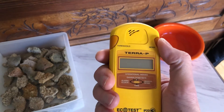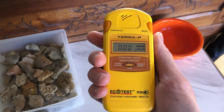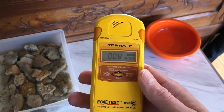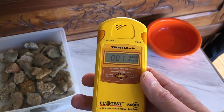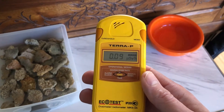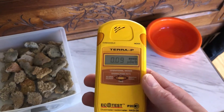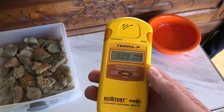I'm going to go ahead and turn it on. It goes into the last mode it was in, which is the gamma dose rate. In a moment you should start hearing some clicking, which is just the background radiation. I live in Colorado — the background radiation here is just naturally a little bit higher, usually around 0.12. This will go up a bit as it stays on because it's averaging it over time.